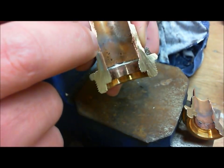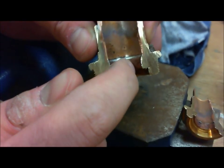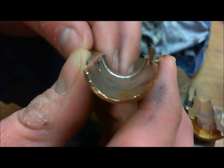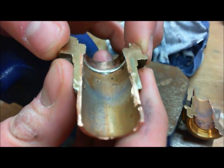But the point of what I'm doing here: if you see solder all the way at the bottom here, that's where the waterproofing begins. When the water is coming through, in whatever direction, the water is going to try to go from here and then try to bypass up the sides. All right? When water cannot get anywhere because it's waterproof, now the water just beautifully flows by. And as you can see, if the water is flowing this direction, maybe you can see a little bit better there, it looks like there's a ridge, like there's a bump. But actually it's concave right here. So the water is just going to skip past that and have no problems. All right, that's the beauty of a good solder joint.